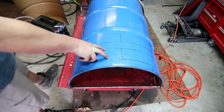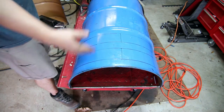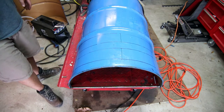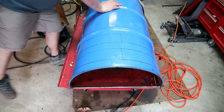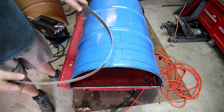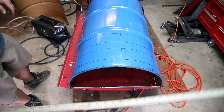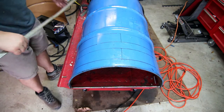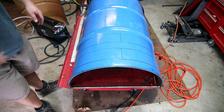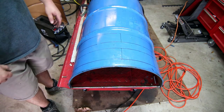What you're looking at here are our two slits for the tires. I offset two inches from each end, two inches in between, these are three inches each — total of 12 inches — and we're doing four inches up off the ground on each side. The way I drew the lines was with a flexible ruler I use for plastic cutting, just forced it against the lip. You could also use painter's tape to get a pretty accurate line, but I don't like that because it burns. Now I'm going to get the plasma set up again and basically just freehand cut out all these lines.